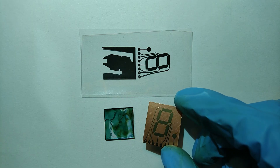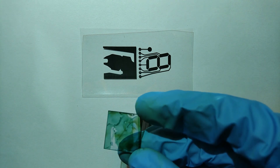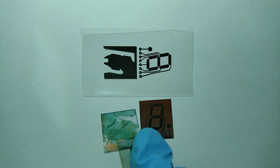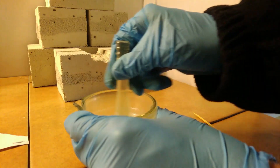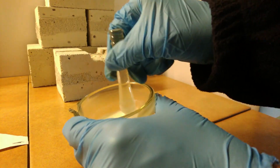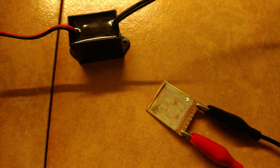Here's what I did. I used a PCB to make the display segments. For the front part, I used glass coated with indium tin oxide, a transparent conductor — this part was also etched just like a PCB. The phosphor was mixed with epoxy resin and applied between the PCB and glass. A small drop of Galinstan is used to make the contact between the top electrode and the bottom, as it is not possible to solder on glass. However, it does not work.